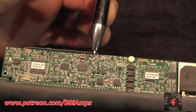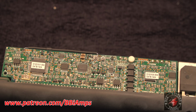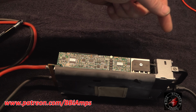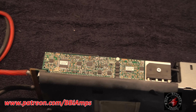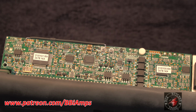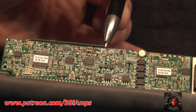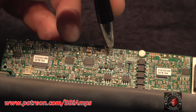This is your potentiometer that adjusts your voltage. This is the potentiometer that adjusts the crowbar protection. And let me zoom out so you have a field of reference. This is your positive rail, if the power supply was laying flat and the plug was on the far left-hand corner, farther away from us, this side, okay? Now, what he suggested to be able to get to 13 volts, which kind of unlocked all of this for me, was that we put a 15K resistor here, from this pad to this leg on the variable. Now please note how I have the variables adjusted. This one is turned all the way to the left, and this one's right down the middle.